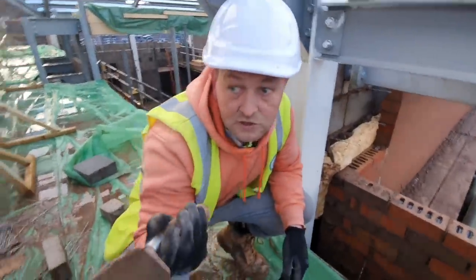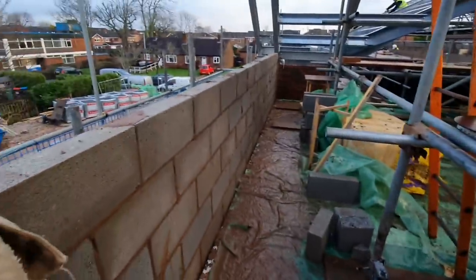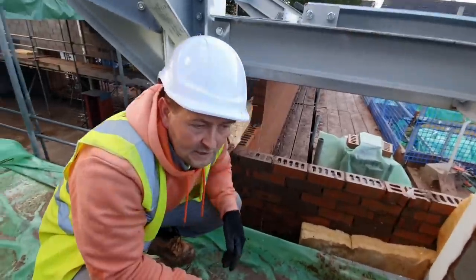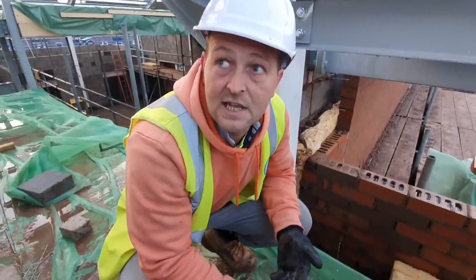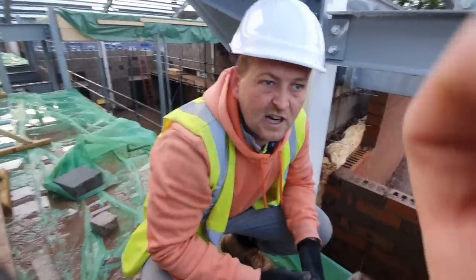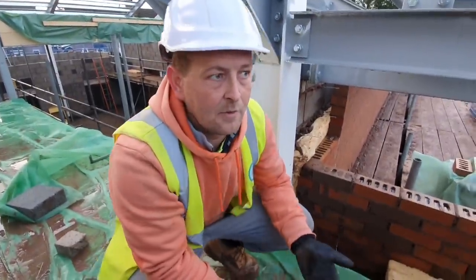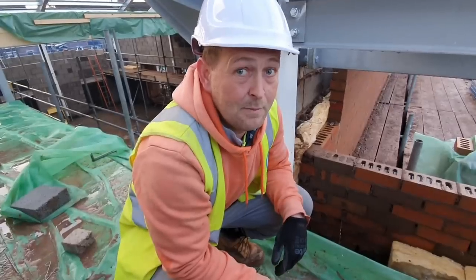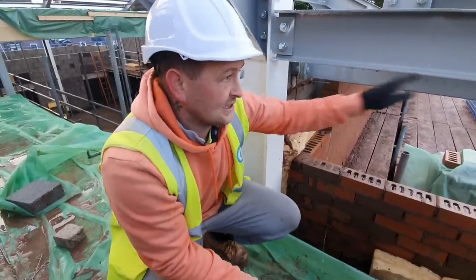Right, if you have a quick scan across there, that's up to the height where I'm happy that we're going to get the outside scaffold to the same height, and then we'll do them the same so we can walk blocks in and out. And I'll have a word with the site manager about that. But I'm not going to put that any higher, and I don't want the wind grabbing it until it's been backed up with brick.